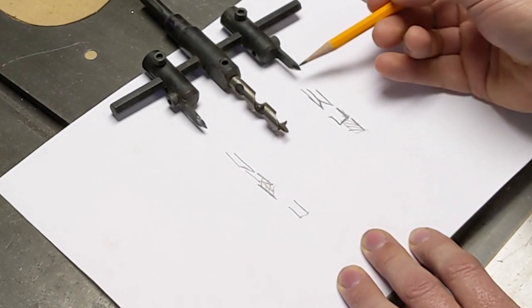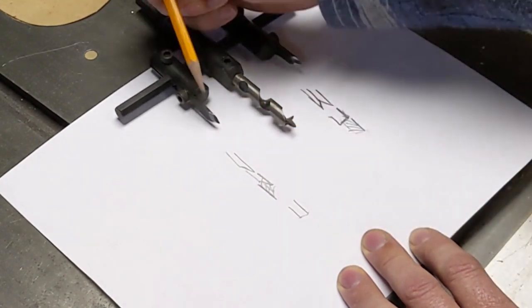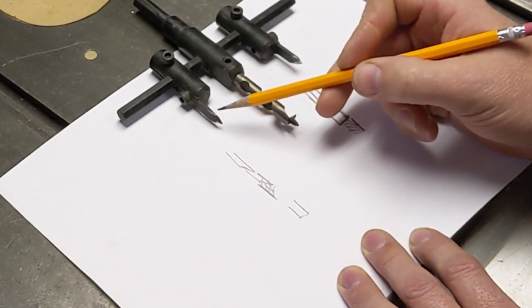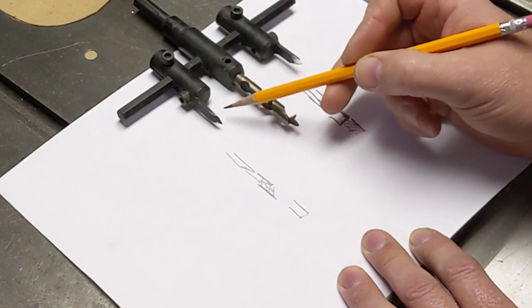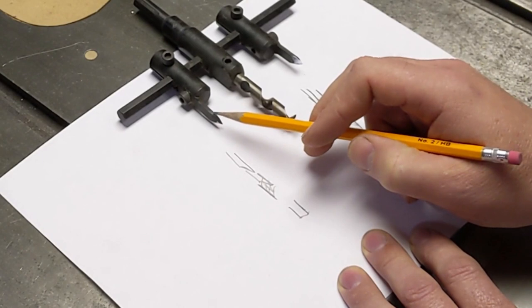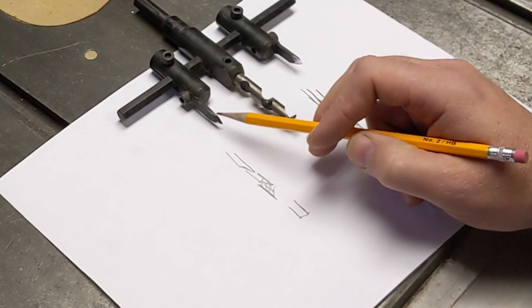We need to set this such that the sharp slice is to the very outside of the hole we intend to cut. The inner chisel should make a narrow kerf, but not narrower than the width of the chisel itself — otherwise the face will strike the outside of the hole. A wider kerf asks the tool to do a little extra cutting it doesn't need to do, but I err on the side of making sure the kerf is wide enough. With this blade — about three thirty-seconds, a little more than a sixteenth — I'll create a kerf give or take an eighth of an inch wide.